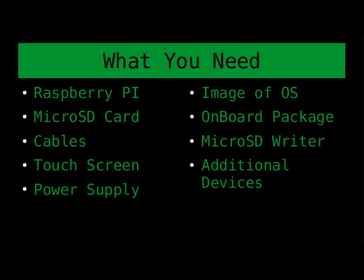Just be aware, a lot of those power banks will cut the power off abruptly to whatever they're charging, which means your device. And yes, they do work. I used to run them all the time. These Raspberry Pis can be powered off these power supplies, but not every power supply can power the Raspberry Pi. Raspberry Pis use a ton of power, so it needs to be something that is going to supply the draw for the Raspberry Pi.